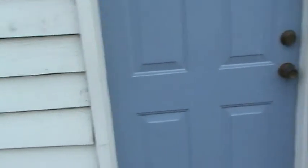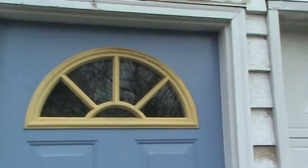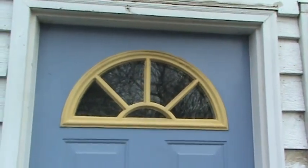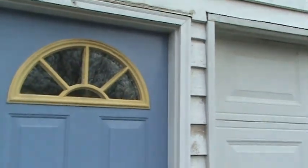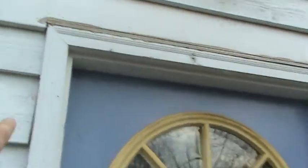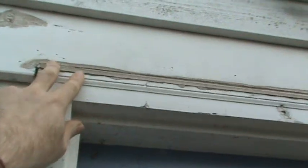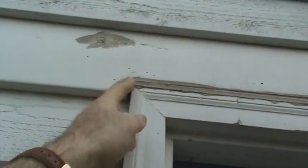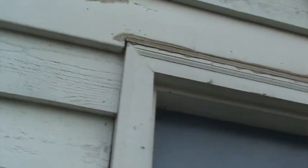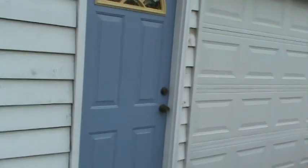What's happened here, as you can see on this entry door, the frame and the molding are rotted and need to be repaired, and the left side of the frame on this door is rotted out as well. We talk about plastic and poly a lot — this used to be white and it's turned yellow over time from age and UV rays. Whoever installed this door just put a strip of wood above it to fill the gap against the cedar — it should be metal flashing and it should extend out to where my finger is. So the water is getting right through here. The repairs we make we back prime everything and seal it all up nice so it'll never rot again, and if it does it'll cost us to come out and fix it for free — we've never had to do that in all the years we've been here.